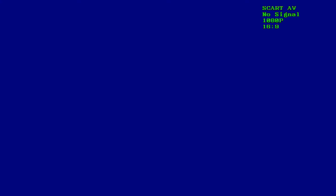This is what it looks like on your screen when you have the box powered on but no signal going through it — it just rotates through different colored backgrounds. I've already tested some systems and I'm happy to say that most of them work: the Saturn works, the PlayStation 2 works. The Dreamcast however does not work — the box reads it as a PAL system and does not display a picture, so I might have to use S-Video with the Dreamcast still. That's why I got this box, because it has not only a SCART input but also an S-Video input.